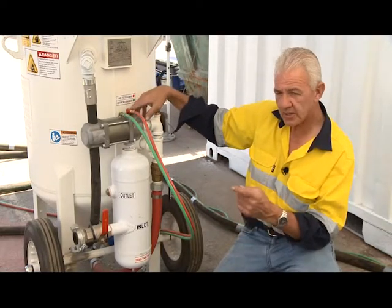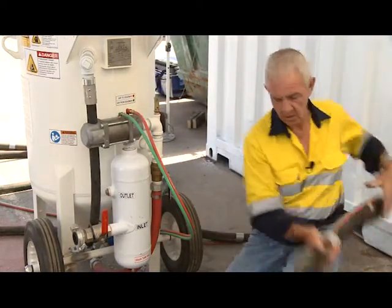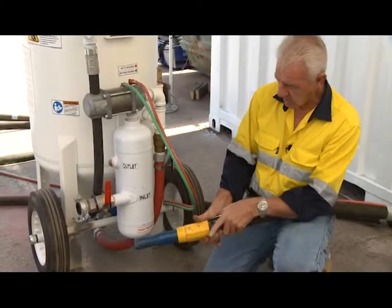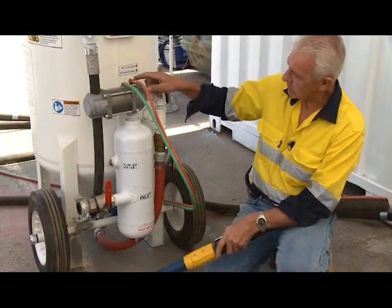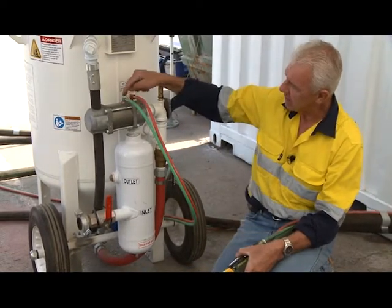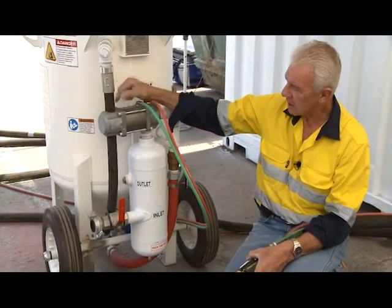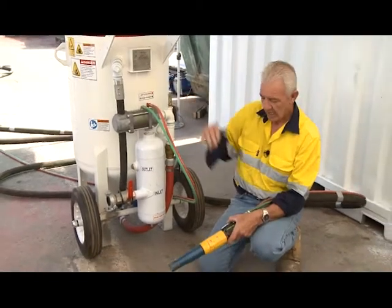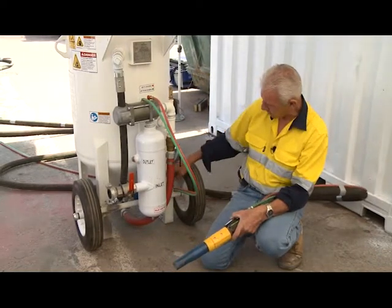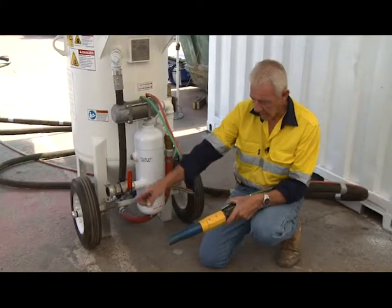So only when you open the dead man — by pushing the safety pin in and pushing that handle — does this receive a signal. The positive air comes down through the red line, returns via the green line, and the green line pushes that piston across so the wedge pinches the hose, closes it off, pressurises the pot, and the grit starts falling through with the main air line — the pusher line — down through to the micro valve, and the grit and air travel through and come out the end.